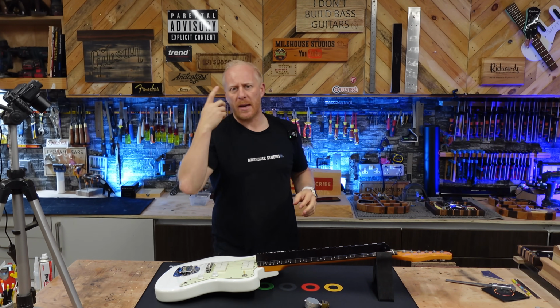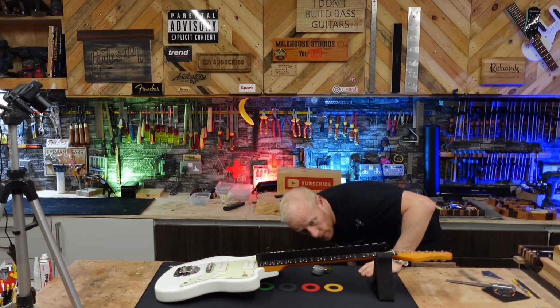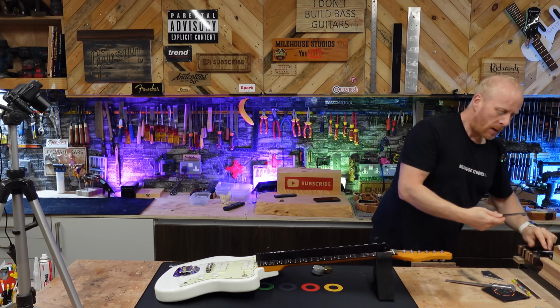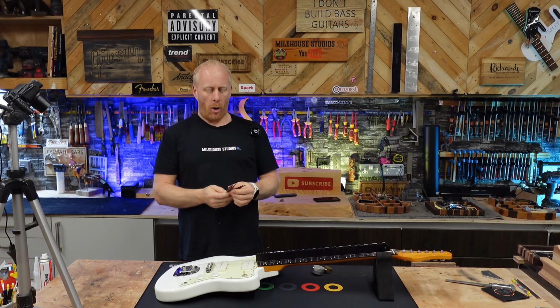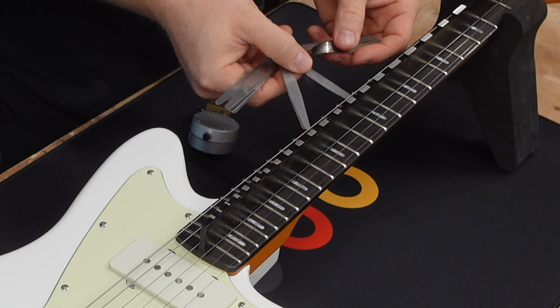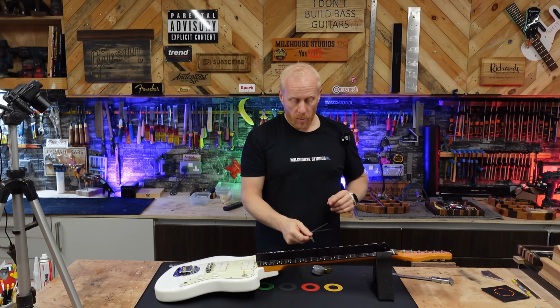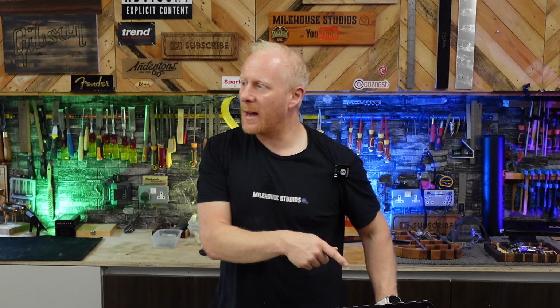Anyway, but before I get my Kleenex out, not for my eyes, let's have a little look. I've got a little bit more relief than I'd like, only a tiny bit. But because I like to show that I'm maturing, I'm growing as a videographer, let's actually measure that relief. It's 0.1 of a mil, which I think is a bit too much. I want to get to 0.05 really. So let's adjust that, all right?